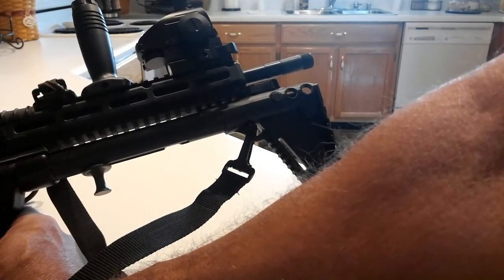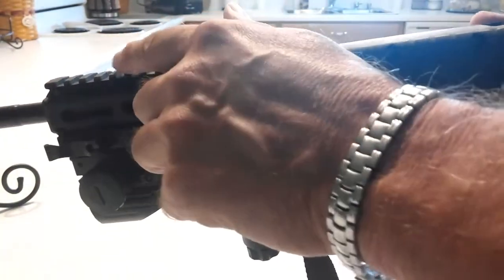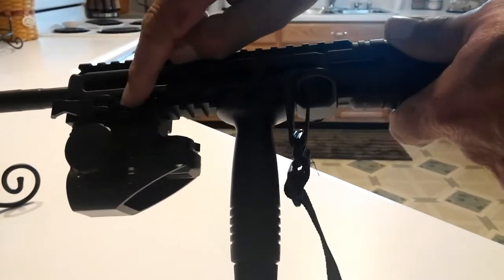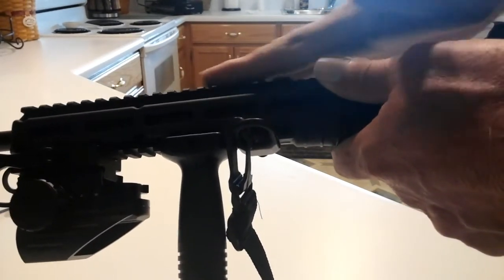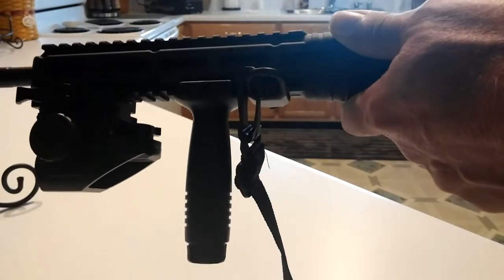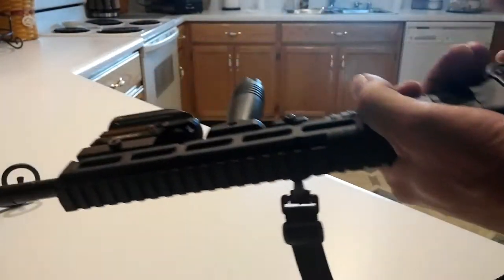Now, there's one thing you've got to do to make that happen. For some reason, Kel-Tec makes this Picatinny rail on top kind of rounded or crowned. And the base of this sight is flat right under here. So when you put it on, it kind of wobbles a little bit — it's not real secure. What you've got to do is take a nice flat file and file this section down nice and flat. And every time you put it on, it'll be locked right back in. So that works for me. I know there are lots of different ways people are doing this, but this is the simplest, best deal for me and I love it.